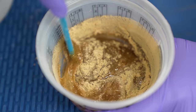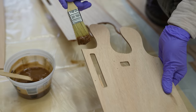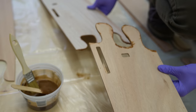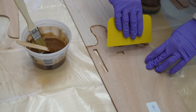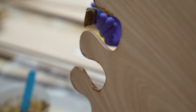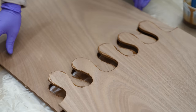The first step here is to mix up some thickened epoxy and glue all of these finger joints together. This is a really common technique in CNC-cut stitch-and-glue boats for extending pieces longer than the sheets of plywood would normally allow. So a really good first day step was just to make all of the pieces full-size pieces, which means that we won't have that holding us up down the line. And this, by the way, is my friend Nico. He and his partner Piper helped a ton during the trailer build, so you might recognize them. He was taking time off before starting a new job and wanted to try his hand at boat building, and I am never going to turn down help sanding and gluing stuff.